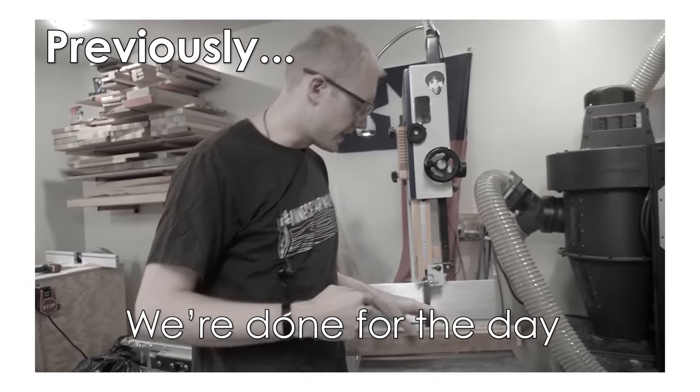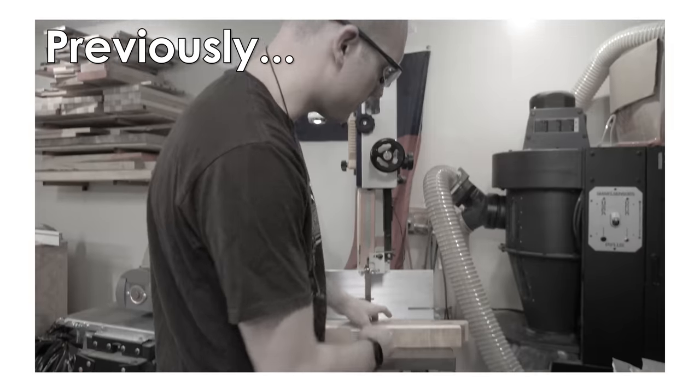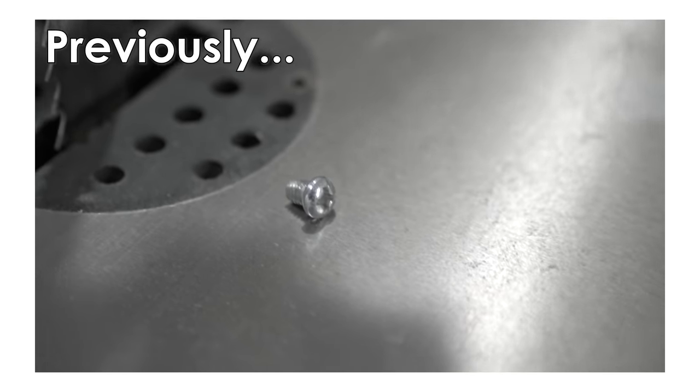We realized that both the waste and labor costs were directly tied to the tools we use. We love our tools — they've been great to us — but it was time for an upgrade in a couple of areas. You guys saw the bandsaw video where I almost got hurt because screws were dropping out of the bandsaw. These bandsaw blades were dull and there were screws dropping out — I didn't even know where they went. We were also dealing with a lot of issues with our planer. We were asking it to do something beyond what it was designed to do. Not only did we have to spend a bunch of time sending boards through the planer, but it wasn't doing a hot job, so we had to put everything through the drum sander to fix the problems the planer was causing. We decided we needed a new bandsaw and a new planer.